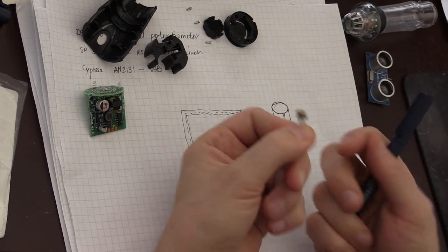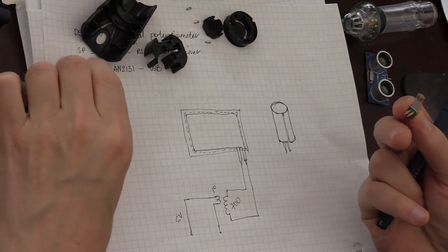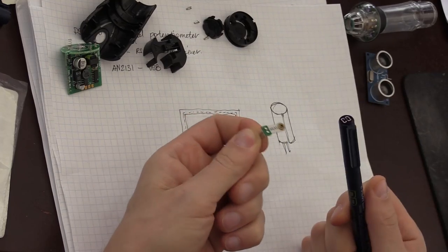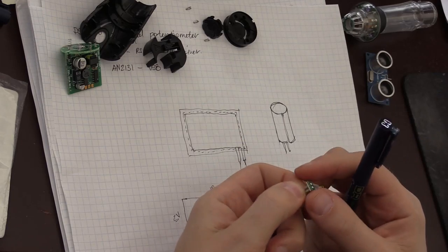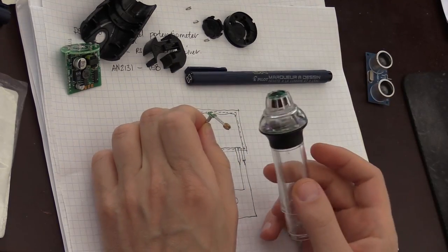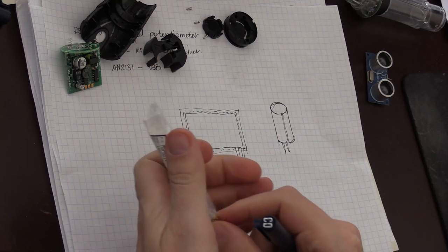I was going to try to see if this will also work both ways, but in order to do that, obviously I have to remove the weight. So I'm probably going to purchase another type of this sensor without the weight on top of it, and try if I can actually use it to generate ultrasound pulses. They also make transceivers like this, which are capable of both receiving and transmitting in the 40 and 80 kilohertz range. So quite interesting sensors.